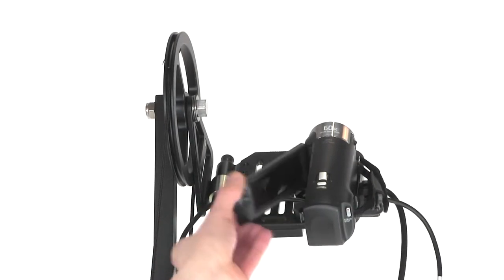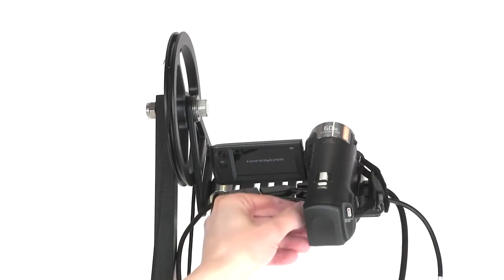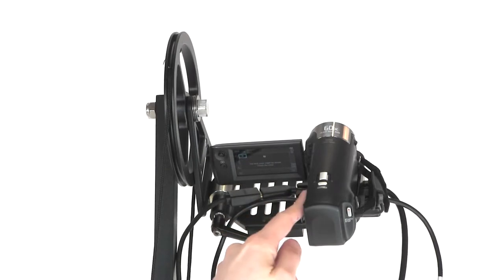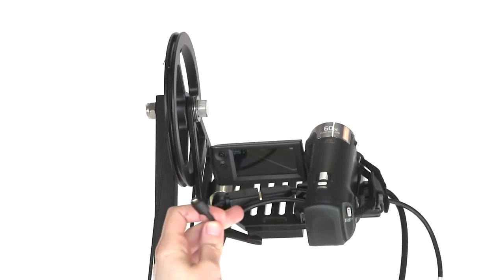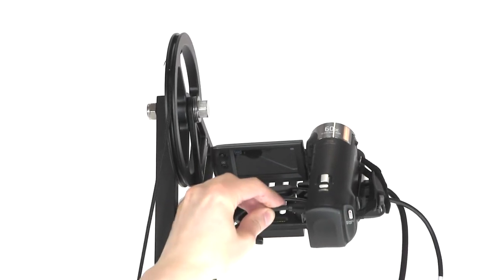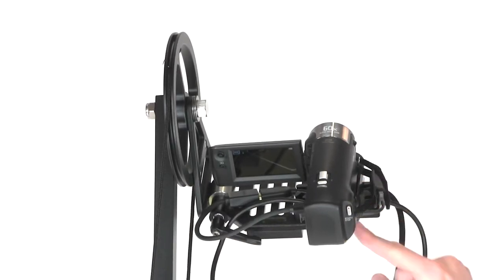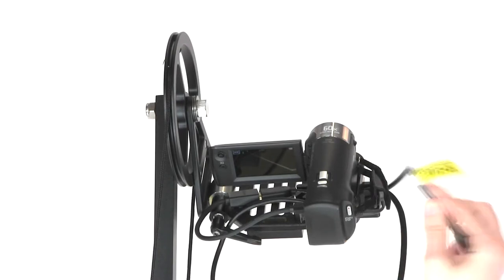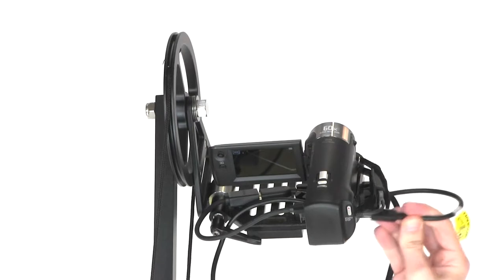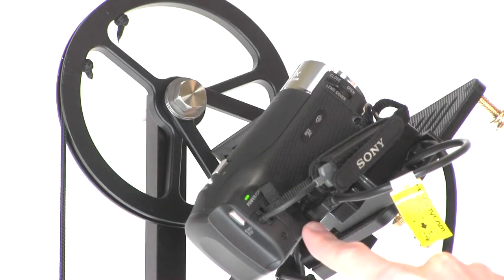Open the camera's LCD window where you will access the HDMI port. You will need to leave that window open for the entire time you're filming to keep the camera on. Inside you'll see the HDMI port next to where the SD card plugs in. Take the HDMI cable and plug it into the port. On the opposite side, near where there's a USB cord in the handle strap, you'll find a little door that says 'multi' — plug the LAN cable into that port. It's the cord with the yellow tag attached.